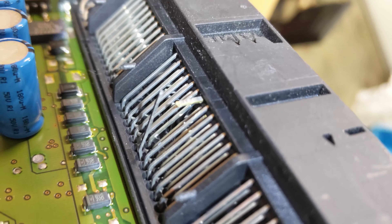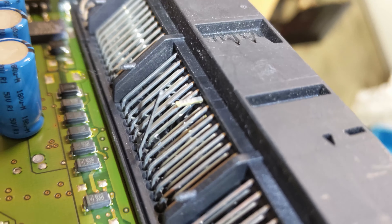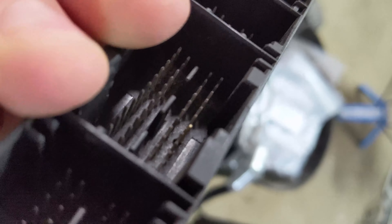You can see here it's sticking out the back. So all I'm going to do now is bend this over, get it lined up there pretty nice, solder that in there, and then I'm going to probably add some epoxy to the backside of this a little bit. And there is the completed repair.